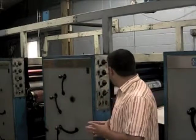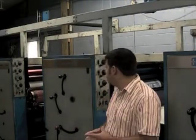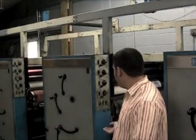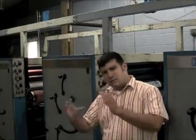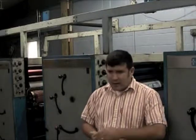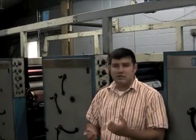Like we talked about in some of the other segments, a lot of this technology is very, very old. It's still just kind of ink, water, and paper. And depending on the mix of ink, depending on the amount of photos on a page, he may need to make small adjustments each way. So he'll use these knobs and these levers here to make adjustments to the water levels, the ink levels, and small, minute adjustments to the roll of paper and where it is itself, just to make sure everything lines up correctly. And after that, there's still a couple more machines here in the press room that are involved in the process, and we'll kind of go around the room and talk a little bit about each one.